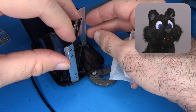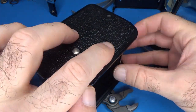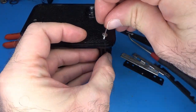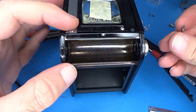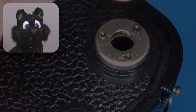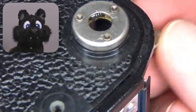Screwing the pieces together was a bit wobbly. It's one of those origami-like cases where either everything snaps into place at once or everything falls apart again. Another nerve-wracking part was the film advance knob — remember those tiny springs? They can fly off quite a large distance. I'm glad I found all of them again. A pinch of grease helps to lubricate the knob as well as hold the springs in check during assembly.